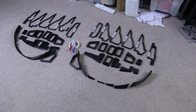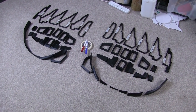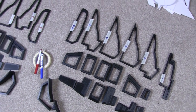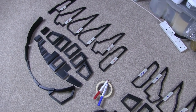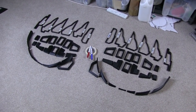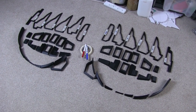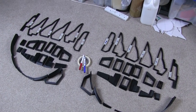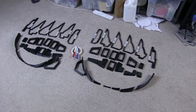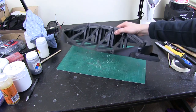I've printed all the parts out — there are quite a lot, probably more than in any previous Hulkbuster episode, and I've still got more to do. I started labelling them with different colour pens — red and blue — then I realised if I just lay them on the floor I don't need to identify them. These are going to get acetone-welded together. This is ABS plastic which dissolves in acetone, so I can chemically weld the parts.